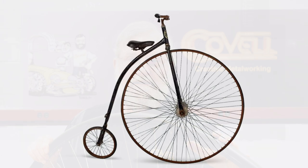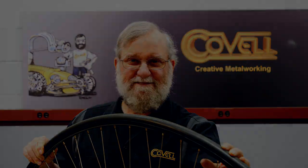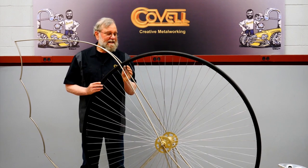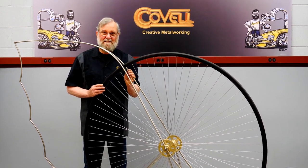The last step is mounting the tire to the rim. I'm using heavy wall rubber tubing here, designed for the old penny farthing bicycles. This material comes in bulk length like a garden hose and is held to the rim by a taut wire. I'll put a link in the description that shows this process. So a complicated shape like this wheel rim can be made by following a series of simple steps.